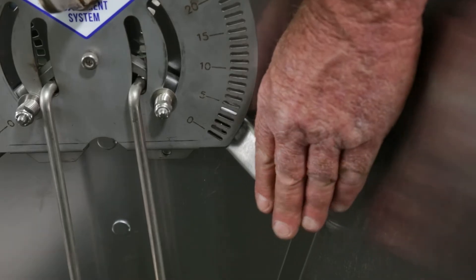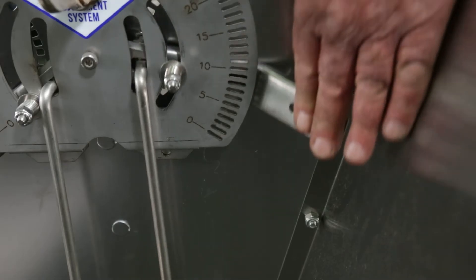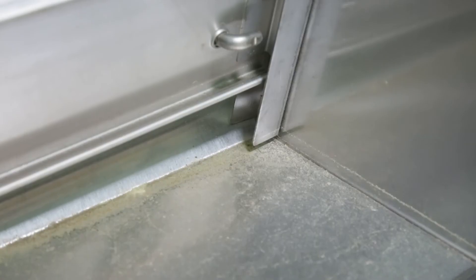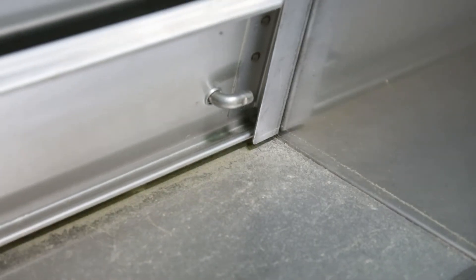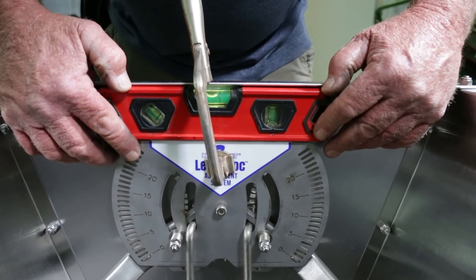Test the levers and rods by raising and lowering the levers on both sides of the plate and verify they move in unison with the sliding feed doors. Make certain the range of the opening matches the indicator of the levers. Verify the plate is level against the interior wall.